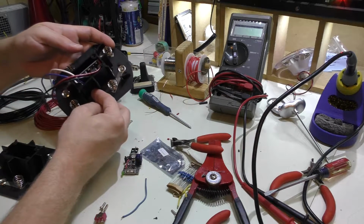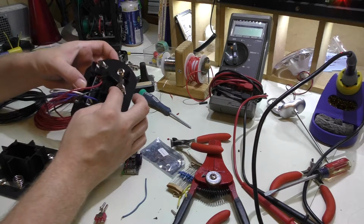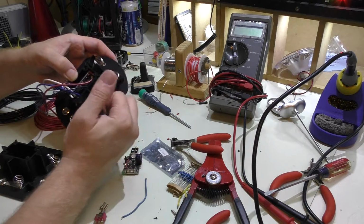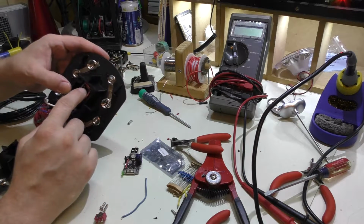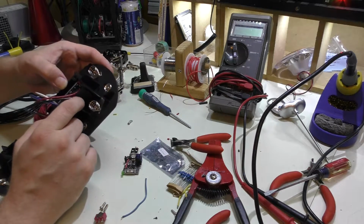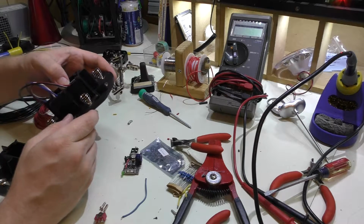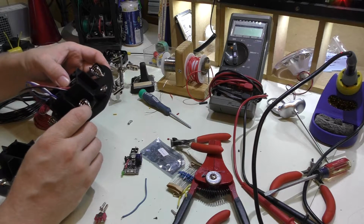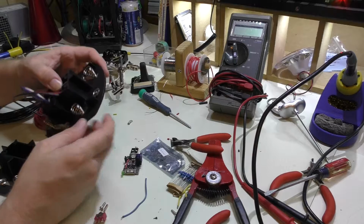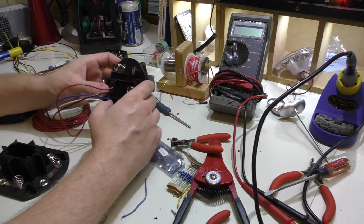And if I can try to engineer a way, hopefully it lines up well, I might be able to find a way to drill a hole and put a real skinny screwdriver in and still be able to access the little trim pot in there if I want to turn up the voltage and tweak it a little bit. Only thing is you'll have to remove one of the batteries, so you'll have to connect it to an external power source, I guess, when the batteries are disconnected, and tweak it that way, and then obviously reinstall the batteries.